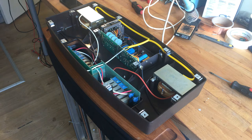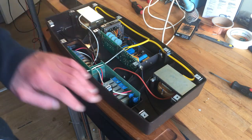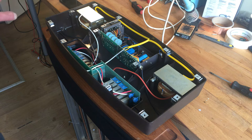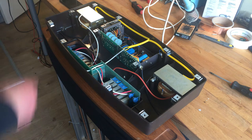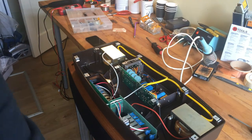But I can tell you this: you have to open up the backside and make sure it's all discharged. You can discharge the high voltage, it's the pinkish cable, by shorting it out with something earthed, like a heater, on the bare metal. At least in the Netherlands, these are grounded, so you will discharge them. Do it several times, or leave it for 5 minutes on the heater, and then it's discharged. But it's all at your own risk.